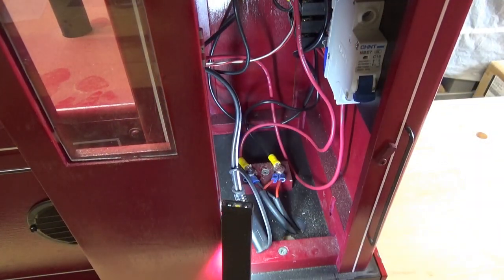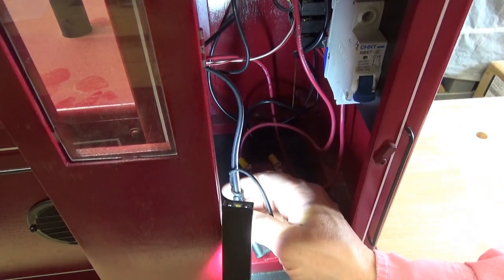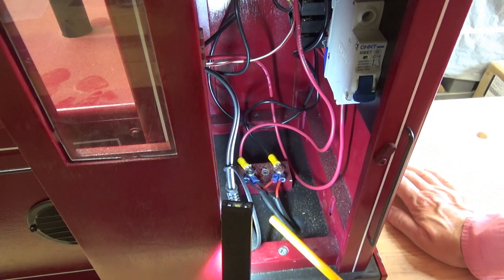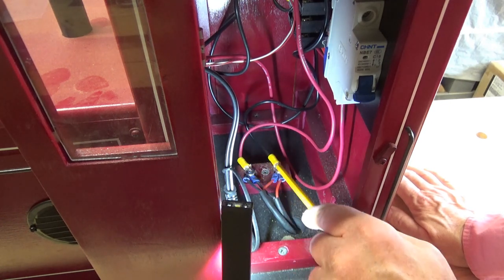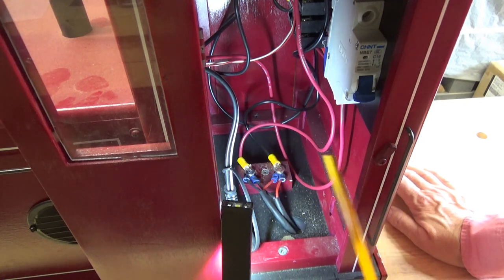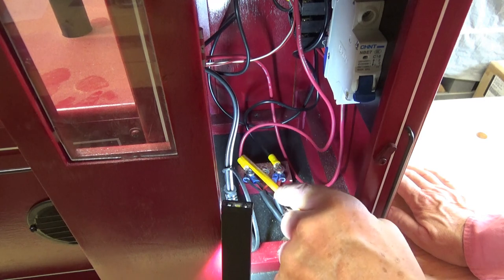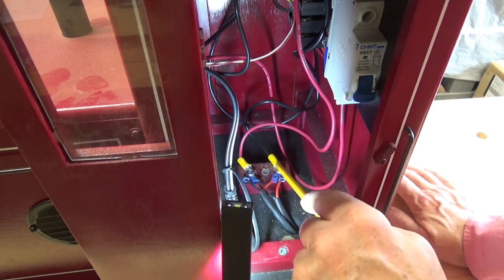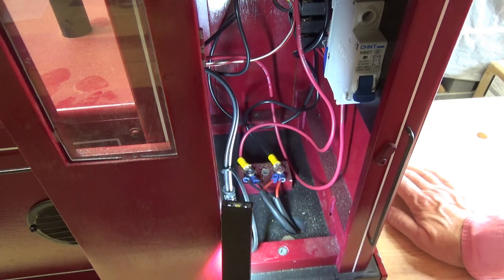Let's take a look in the cab — you can see it needs to be hoovered out. Some dust and dirt still gets in there, even though I've got doors and plastic in the windows. This is the charging cord here; it's got a little rubber cap on the end. But I've always kind of worried that if the cover comes off, I've got open terminals here that reflect the two terminals on the battery. So I always worry that this is going to come into contact and create some sparks — there's a potential of 12 volts across here when he's running, which could cause some excitement we don't want.